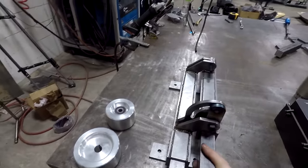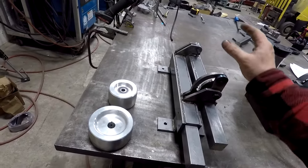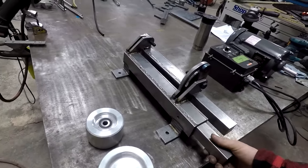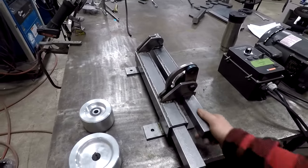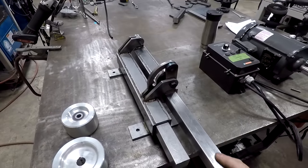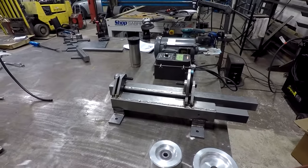The customer supplied all the material but didn't supply quite enough of it. But it's coming along — I've got about 10 hours in up to this point. It was a lot of finicky work: making the box tube, it was moving and warping, and you have to move all over the place and keep heat out of it so that these pieces are still sliding in and out. There was very little clearance — this one had 8 thou of clearance all around; this one I did 16 thou. It still gets a little snug at the back, which is fine because it's never going to go in that far anyways. That's where I got today on this project.